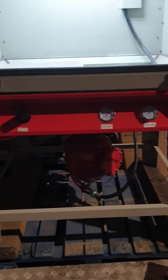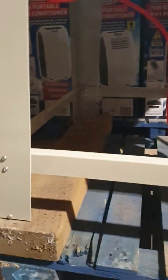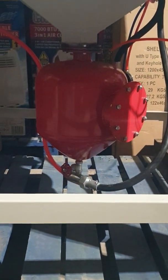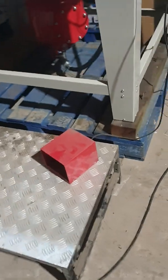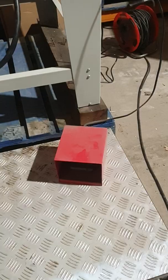They just want to upgrade it to a pressure cabinet. Because of the pot, it hangs on a lot more weight with the hopper, so you'll notice on this one here it's up on skids — otherwise the pot is going to be on the floor. So you need to raise your cabinet whatever cabinet you've got, and then because of that obviously you're going to have to invest in a step. I've pinched the step and the foot pedal off my pressure cabinet.